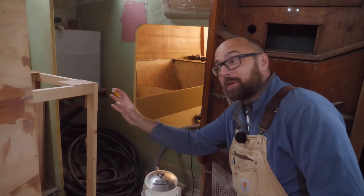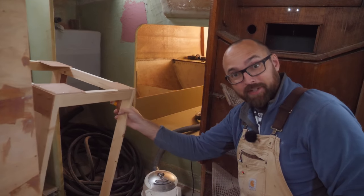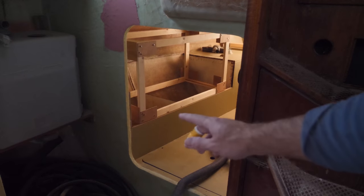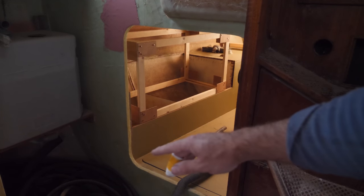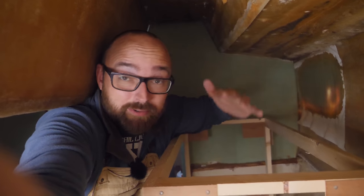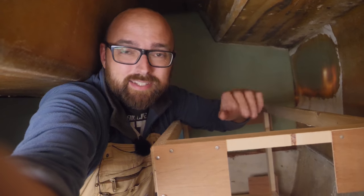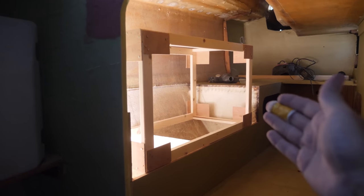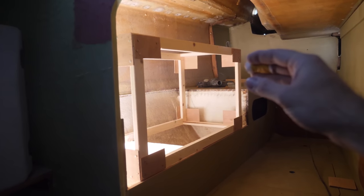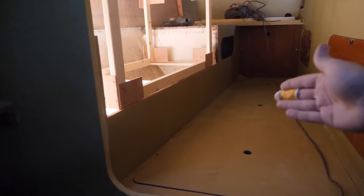After a little bit of fiddling around I ended up building myself a little mock-up of the generator, just like I did with the washer and the dryer in the forward cabin. With the mock-up it was pretty easy to figure out that is as low as I can possibly go. I've still got room underneath the generator to run all of the conduit and hoses that need to go from the head into the technical compartment. Also there is plenty of room above the generator, which is kind of nice, and where the camera is located now there's room enough for the little diesel heater and possibly the isolation transformer. I wouldn't go as far as calling my little technical compartment cavernous, but there is very good access to the generator, the heater, the isolation transformer, also the main engine and the diesel tank, plus the storage beneath this old bunk.